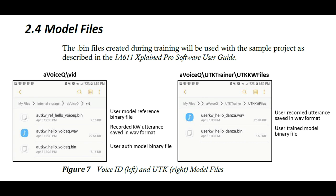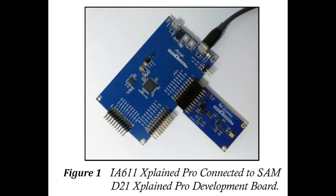The I2C, UART, or SPI interface is what you use to download the audio model. You do have to set up the microphone — it's not trivial — but there is example code for all of this, and there's a dev board as well. Folks familiar with the SAM D21, Atmel Start, and Atmel Studio will find it pretty easy. You can use the built-in default model, which includes a few examples like 'turn on the lights' and 'pause the music.'